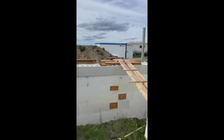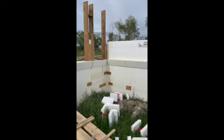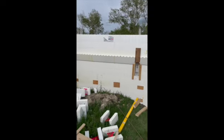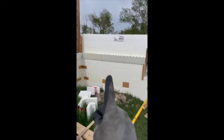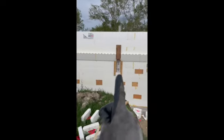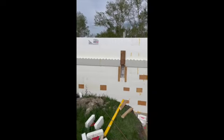This will be suspended garage floor. Suspended concrete slab. Perimeter is supported with a ledger block. And then the design called for 3 beams. One there, one there, and one there. And they span all the way across.